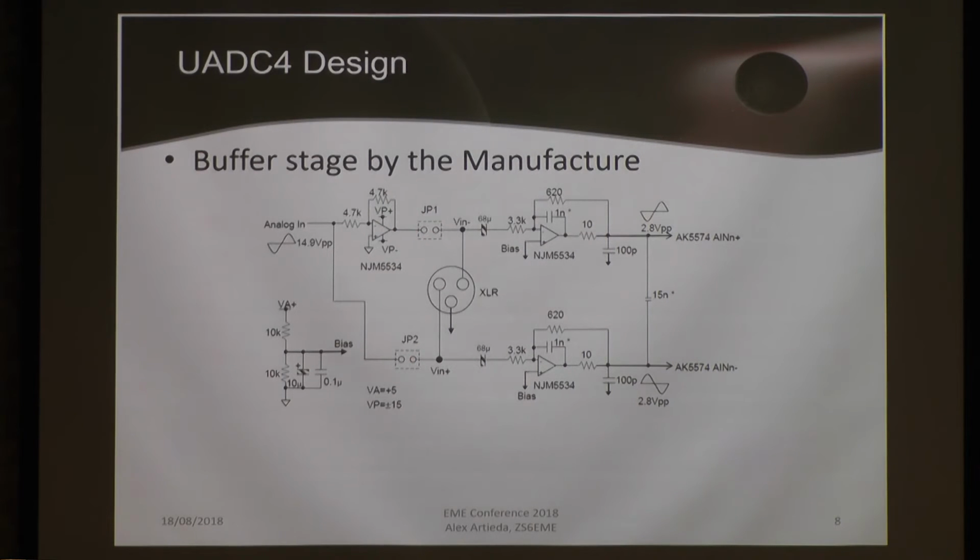When the jumpers are installed, this op-amp is looking at the signal through this op-amp. That means we have an active device here, where the input signal just comes straight through. And I found this in every single audio card. And what is the problem here? Look at the resistors. My source resistor is 4.7 kilo ohms. The feedback resistor is 4.7 kilo ohms. They are in a ratio of 1-to-1. Okay? That means it's preserving the amplitude.